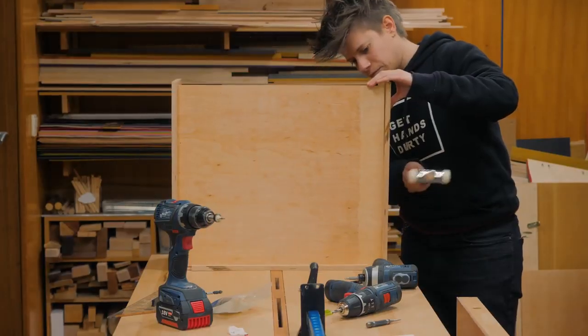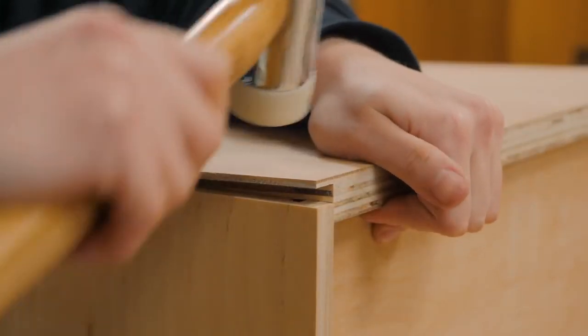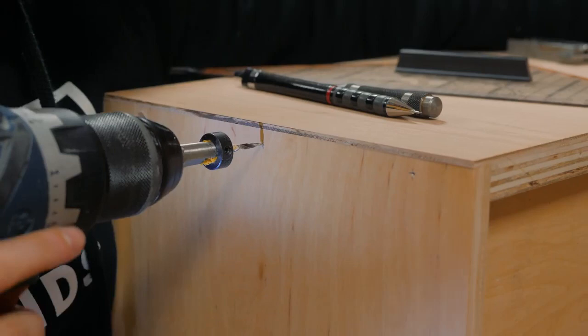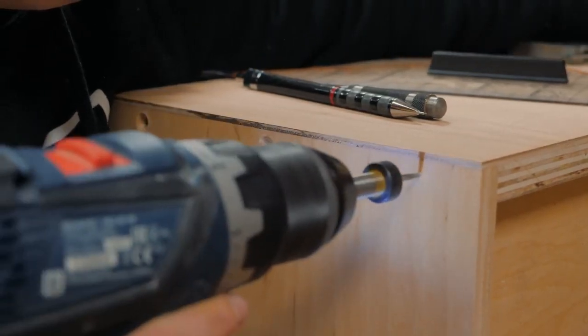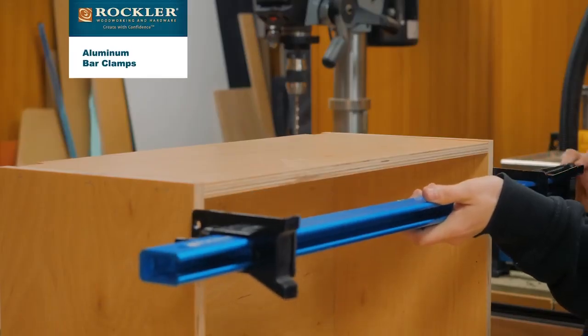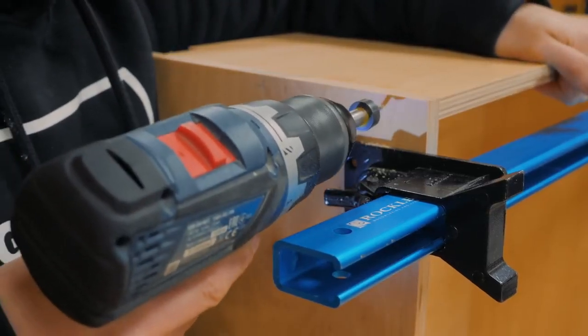Crafted Workshop has a great video explaining how to install this type of drawer slides, and I basically followed Johnny's indications to install mine. I didn't apply any glue because I don't think it is necessary, as I was going to use wood screws anyway, and also being a pre-finished wood, at some of the joints it wouldn't really work unless the area of contact gets fully scratched to accept the glue.